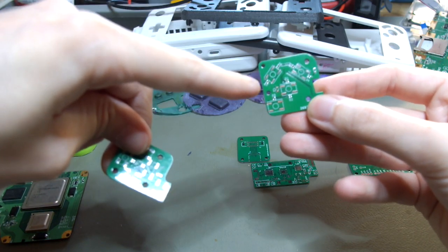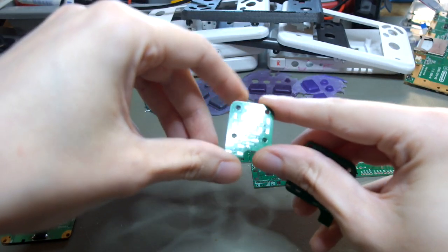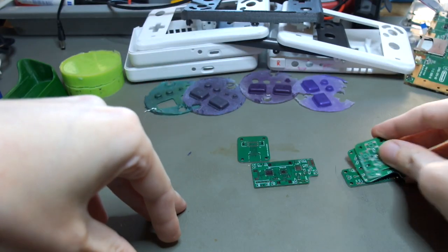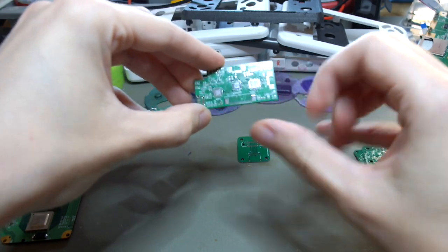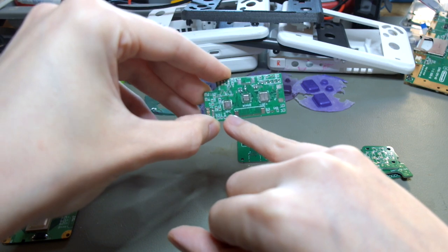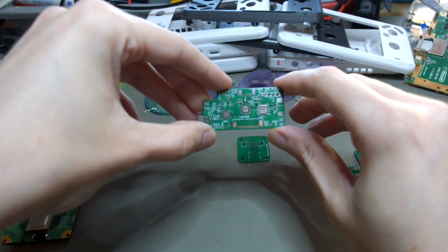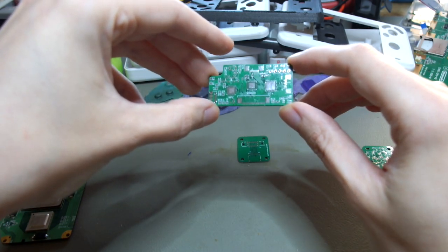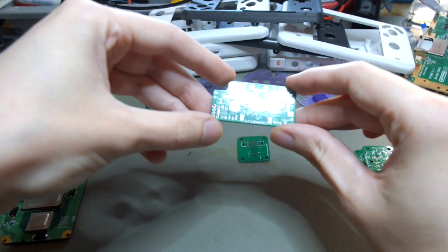Every button has two LEDs, which are special smart LEDs, SK6805 LEDs, which can be controlled by a microcontroller. And this microcontroller sits on the main PCB, which is this one. It includes a microcontroller that's programmed with the software I made. I called it the NPC, Knowles Portable Coprocessor. It's an SAMD21 microcontroller. Also, we have the audio amp and the GC Plus controller on here. So basically, this is the main PCB which handles all kinds of stuff.